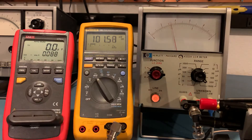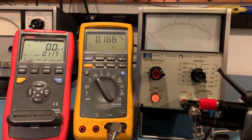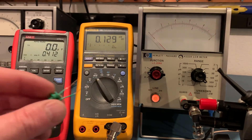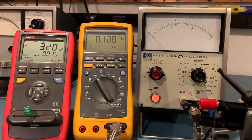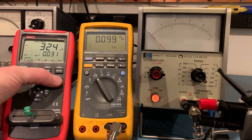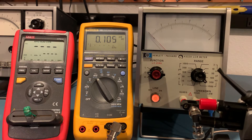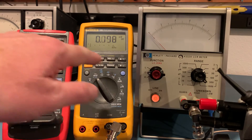So that shows how it works in both resistance and capacitance. I do have one inductor here — I wound this just to test this meter. Let's plug it in and switch to inductance. At 1kHz it's reading about 77 microhenries, so this is going to measure at 1kHz.